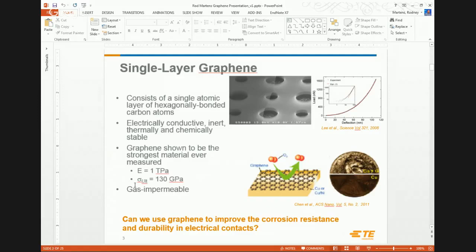To talk about graphene fundamentally — graphene, carbon nanotubes, and buckyballs are still a bit on the upward swing of the hype curve. But if you've read about the material, you consistently hear it's the strongest material ever measured, with a modulus on the order of a terapascal and strengths of 130 gigapascals. Some work by Lee and others etched holes in silicon, transferred graphene sheets over them, and used a nano-indenter to probe the suspended graphene and extract material properties — deflecting on the order of nanometers under nano-newton loads.